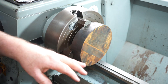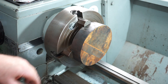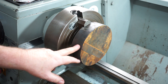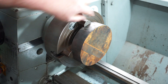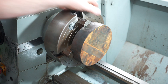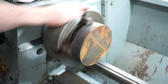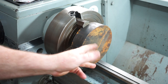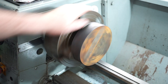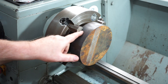I didn't clock it in — all I used was the concentric rings on the chuck face and I've got it pretty close. Now considering it is cast and has been rough-sawn on a bandsaw, the face will be a little bit out and will be a little bit jittery. But that's not too bad. So I'm going to come in now and face that, then start OD turning it down.